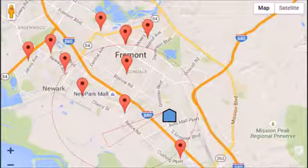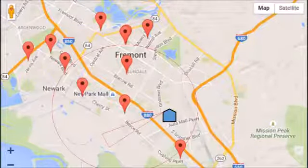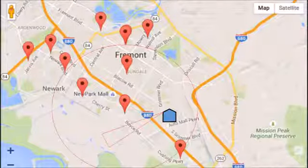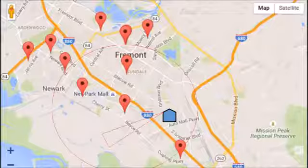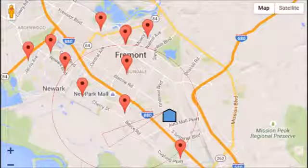Cell phone towers usually have a large radiation pattern, so it's possible that you need an omnidirectional antenna for your donor instead of the Yagi directional. The omnidirectional antenna is only three to four dB of gain, so it's a lower gain antenna. This may help with the amount of signal getting into the booster.